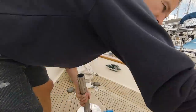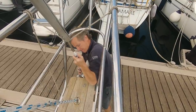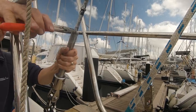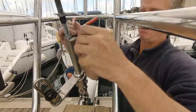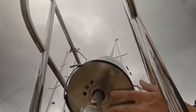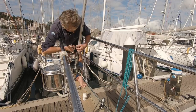A little bit of dry PTFE on the nylon parts. Get everything slid on — top roller and bottom roller — held up with a halyard. I can stretch it down and put the cotter pin in without too much effort. Now that the bottom joint is turning nicely, I can just get the wrench on and do it up — goes back up to where I taped the mark — and that should be as it was before. I can slide the drum down into position; it's got a bearing at the bottom, all greased up. Then it needs to be bolted onto the foil.